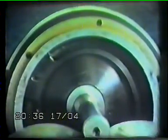The same principles apply equally to an offhand or pedestal grinder. The wheel must be selected to match the speed of the machine spindle. Apply the ring test we've already shown, and then follow with the correct mounting procedure. That is, the guards fitted into position, the work rest properly adjusted, together with the protective screen. The machine is now ready to run.